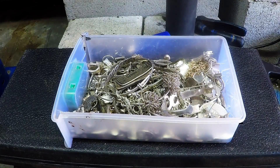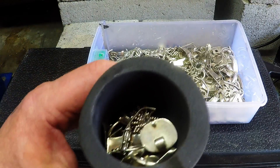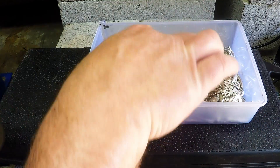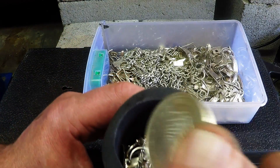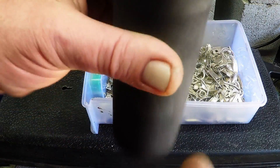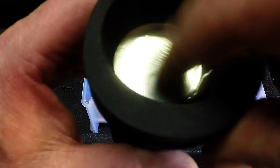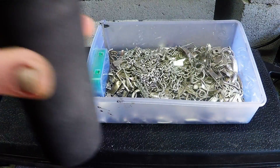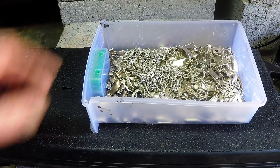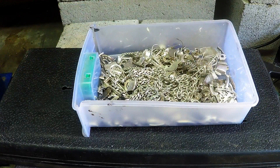I've filled the crucible up. I'll add a little bit of borax on top, and I'll put the silver coin on top just to start it off and weigh it down — as it's melting the weight should push it down. That should be enough to get us started, so I'll put it into the furnace and get it going. As it melts down I'm just going to keep adding more once we've got room in the crucible.